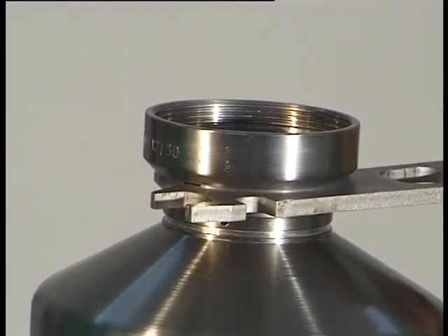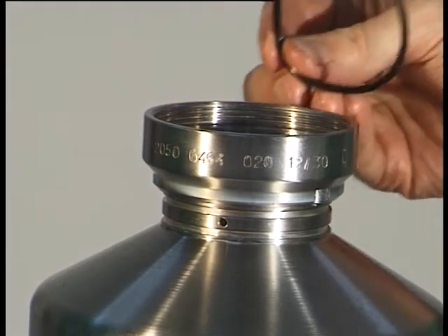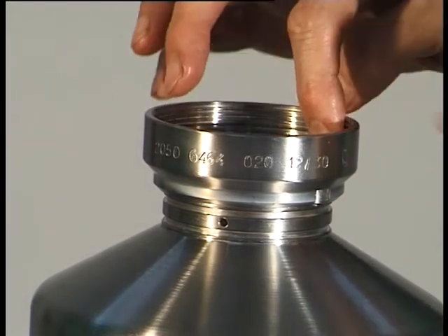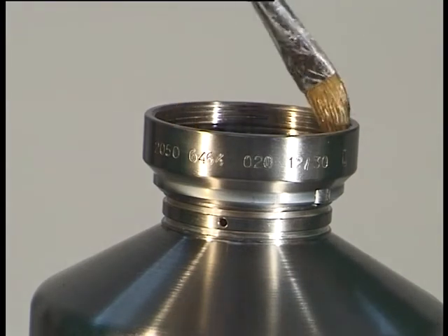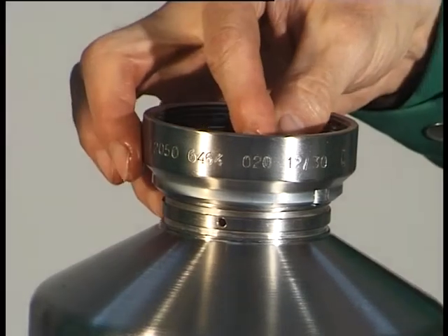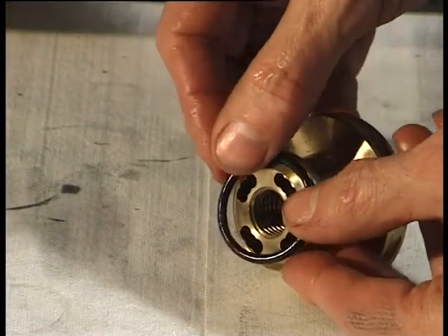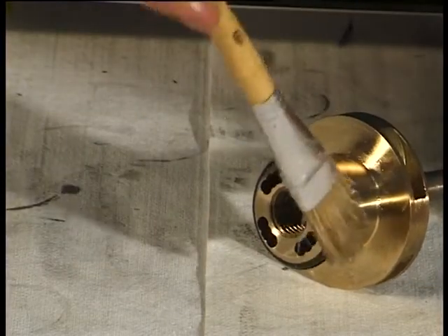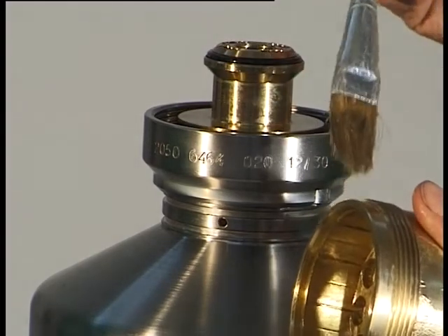Attention: a loose threaded ring can endanger life. Grease and insert the gasket in the groove of the threaded ring. Mount the regulating ring selected from the set of regulating rings. Fit the gasket in the groove of the centripetal pump and grease as specified in the lubrication schedule. Install the centripetal pump; grease threads and guide surfaces in accordance with the lubrication schedule.